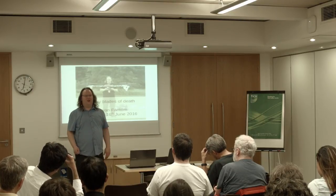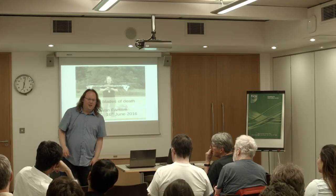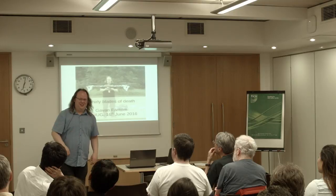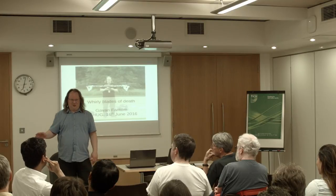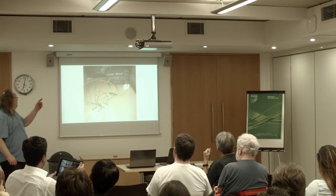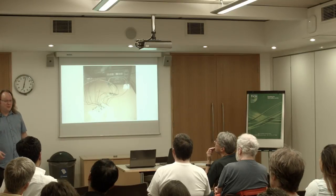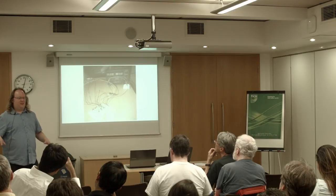So where do we start? The core of a quadrotor project like this is the inertial sensing. In the previous talk there was a mention of inertial sensing — on Android or iOS they do it all for you, you just get one line, you say 'what's my orientation?' and job done. I didn't use Android or iOS for this; I did my own thing. That little white thing by the power supply is a Wii Motion Plus — a little thing that plugs into the end of a Wiimote and it contains a three-axis gyro. At the time three-axis gyros were starting to become available but weren't cheap, and the Wii Motion Plus was a really cheap way of getting hold of one.